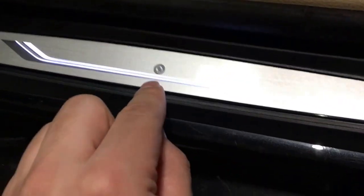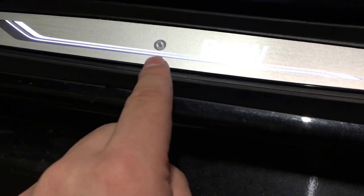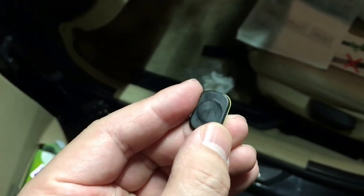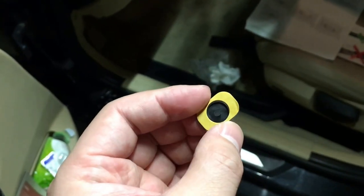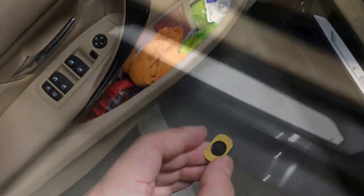The exact position for where you want to place the magnet is on a spot where you can see a little logo with a magnet printed on it. When you put the magnet on that spot, the light will shut off — that's how you know it's in the correct place. These are the little black plastic stickers used to secure the magnets underneath your door. Put them on over the magnet — now it's secured in position.